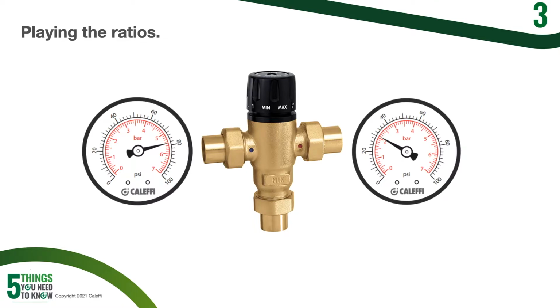not only that, but your pressures on your hot and cold inlets. It's really important to have consistent pressure on each side of the valve. In the case of our 521 series mixing valves, we have a recommendation of no more than a 2-to-1 ratio between hot to cold or cold to hot. If you exceed this 2-to-1 ratio, that mixing valve is not going to be able to perform properly.